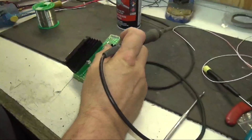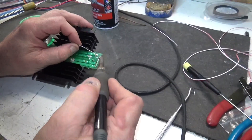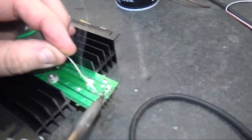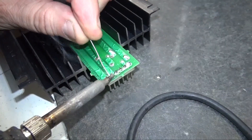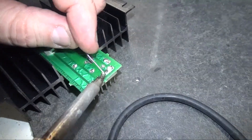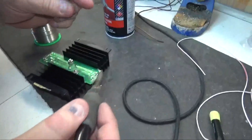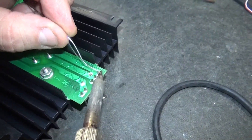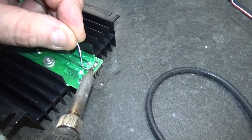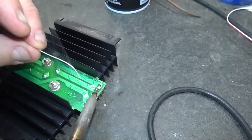Easy to fix — get lead-free solder. Lead-free is important for your health. Oddly enough, all the connectors at the top here are all the same connection, so we just have to load some solder onto all these pins like so. Nice. And we'll do this side now. These we have to be a little more careful because there are two separate connections — these first three are connected together. Nice fresh solder, it's taking quite a bit, and then here.